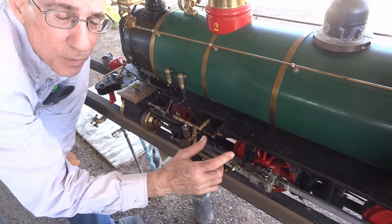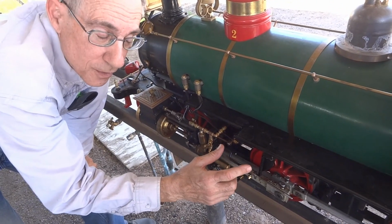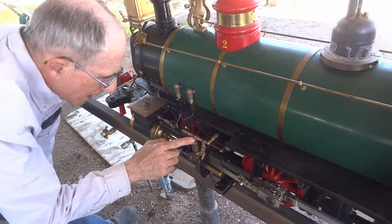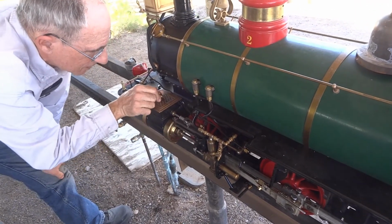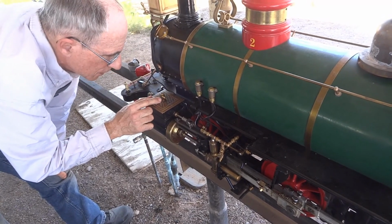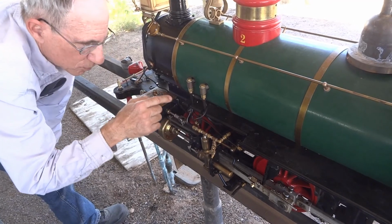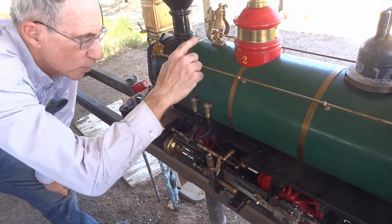That's a mechanical lubricator that adds steam cylinder oil to the steam cylinders. It does so through the stream of steam, comes through a little pipe right down here, connects around, comes over here and ties into this check valve on top. So we're going to get that oil pipe back into place, connect between here and that particular lubricator. And that happens on both sides.